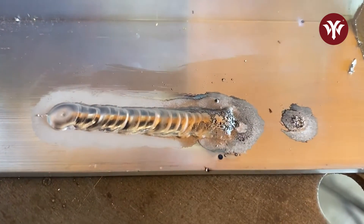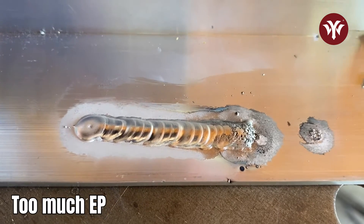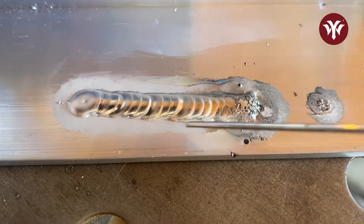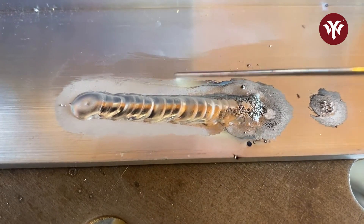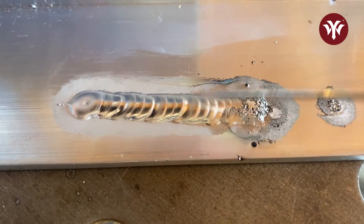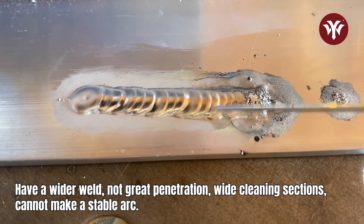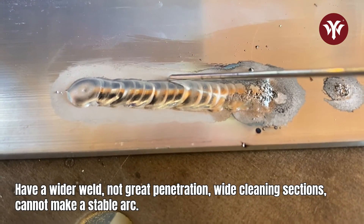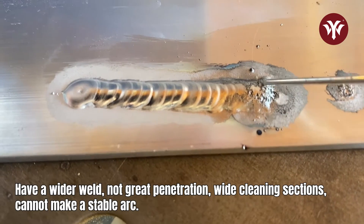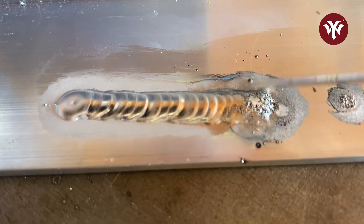Here we can see the balance control high on 65%, and it is running way too much in the EP. We can see this by this very wide cleaning section right here. There's so much energy running EP going into cleaning that the weld is actually suffering — we have a wider weld, not great penetration, a very wide cleaning section. And we have this jumbled up mess where we're actually not running enough EN to make a stable arc, and that's what we're seeing right here.